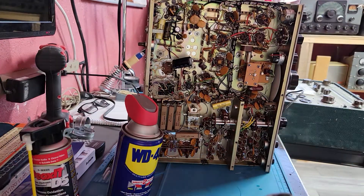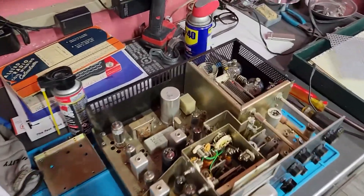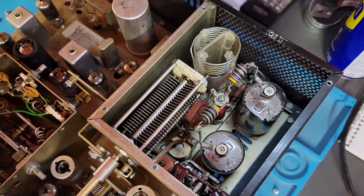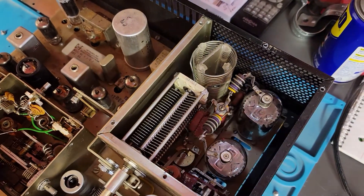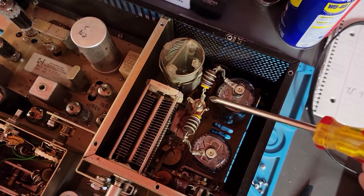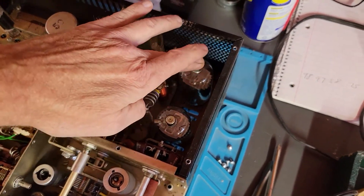I'm going to show you the finals box here. Get everything back together and set up the camera. It does look clean — I don't see anything bad. Don't go in there and hit your finger on one of these either. You want to make sure you discharge them — just in case, which would entail taking a decent-sized screwdriver, touching everything, being liberal with it. You're discharging before you put your mitts in there and start messing with things.